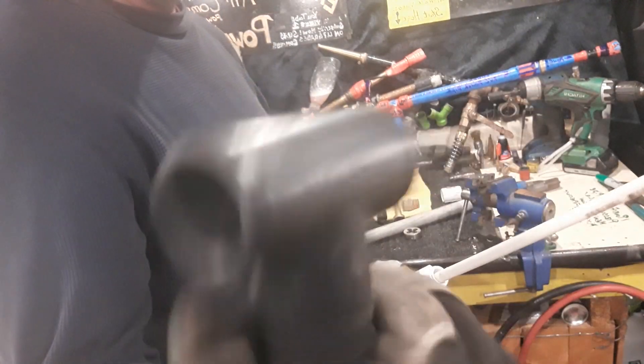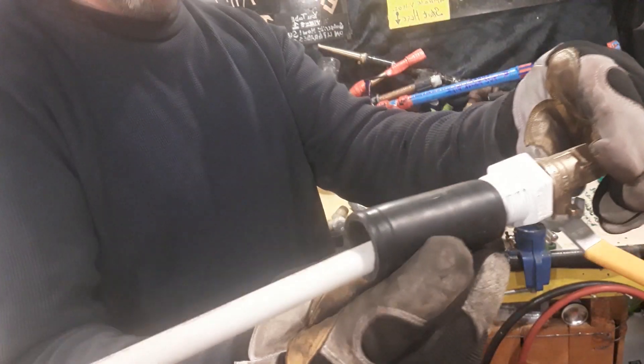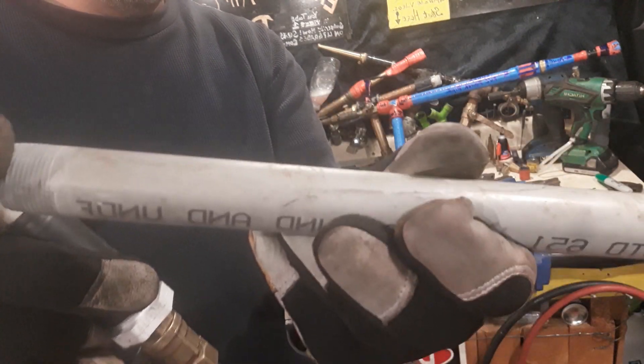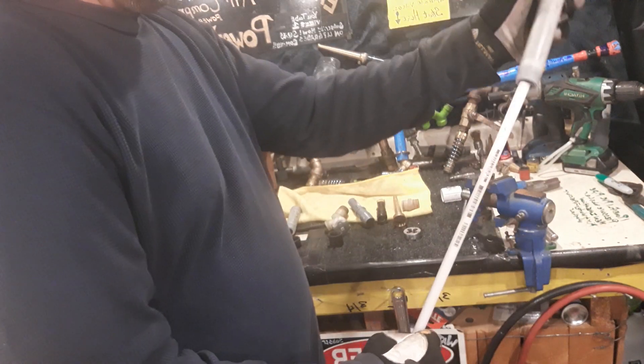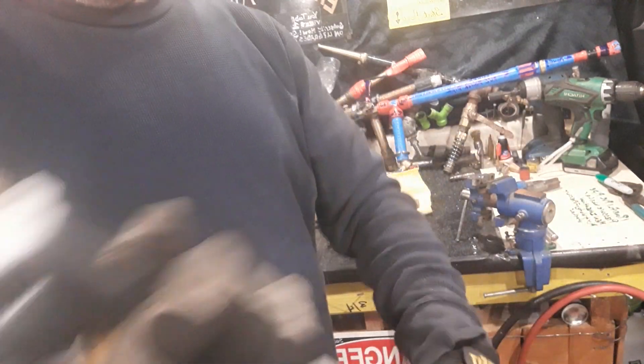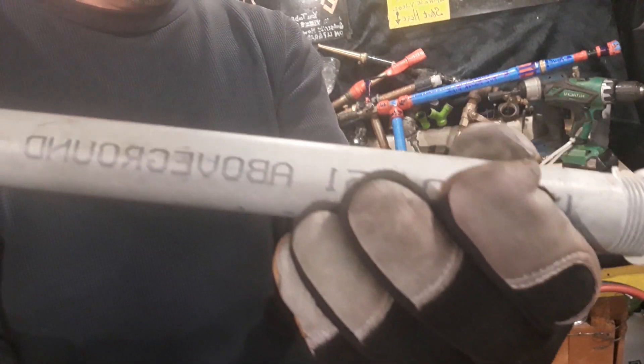On the short side of your inch-and-a-quarter hose barb, you're going to put your pipe — we'll call this the power pipe — and screw that in right there, because we've already made the threads on the inside of this T-fitting. Then take a three-quarter inch schedule 40 electrical conduit PVC and slide it over the top of your quarter-inch SharkBite fitting. Then slide a three-quarter inch coupler over the end of the barrel of your schedule 40 PVC pipe. That's about what it's supposed to look like.